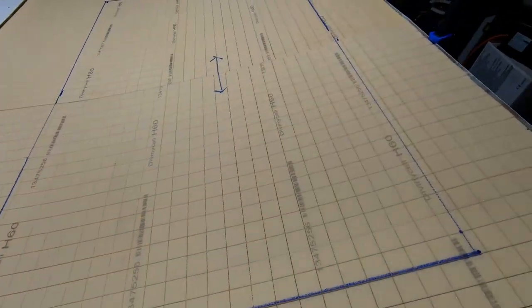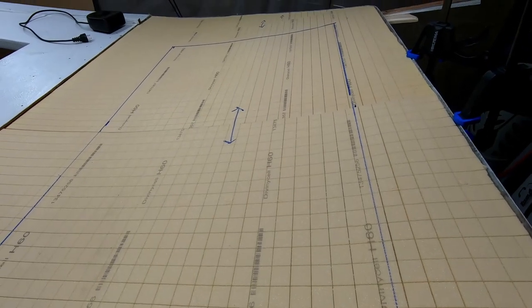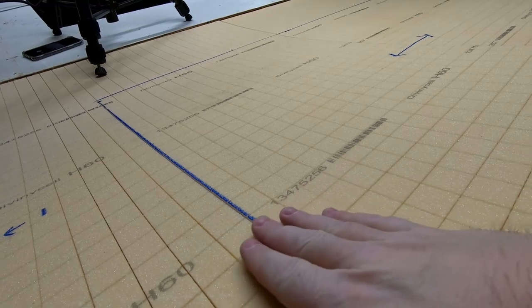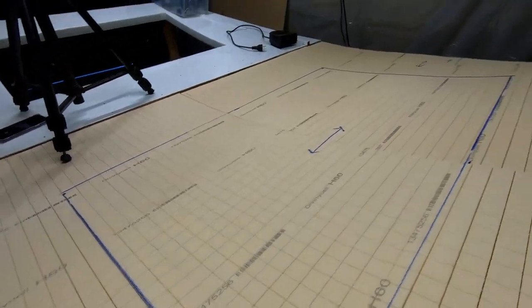I have a solution for that. I'm gonna put in a couple of layers of fiberglass in that area and then fair a bit. I also have to fair up for the last couple of layers on the inside because there is a difference in heights in the roof. Here we have a little bit of a height difference.